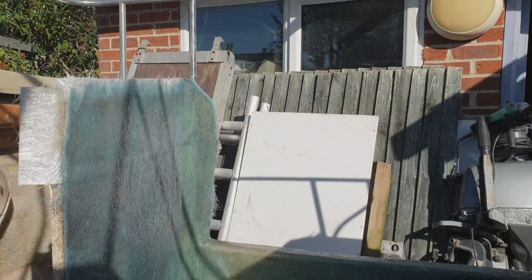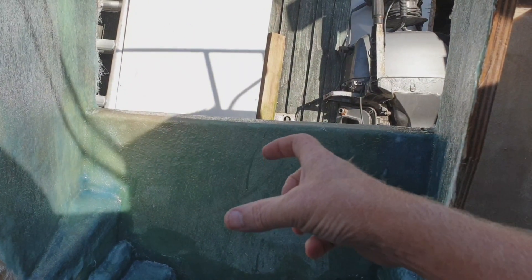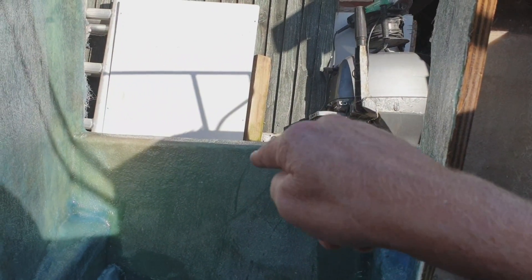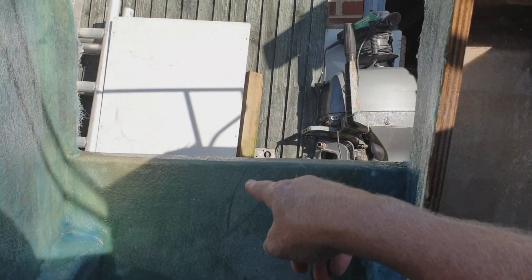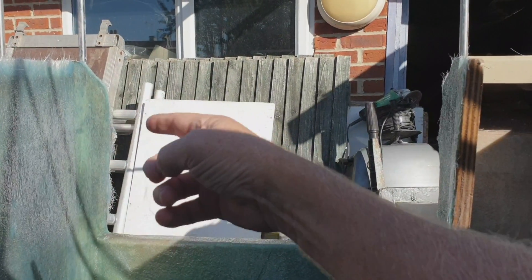So that's where we are today — it's all glassed out now. The transom's done underneath and the two sides are done. When we put the base of the splash well in, I'll drill through the transom — it's called a garboard or something, basically a vent through the hull to drain the splash well. I'm going to drill that through, glass it in, and put more layers on there as well. Then I'll glass the splash well back into the back of the boat to give it more strength, tie it all in, and get it a bit neater too.